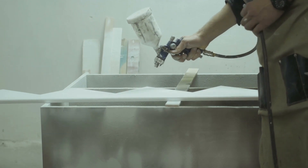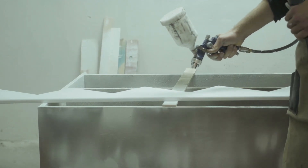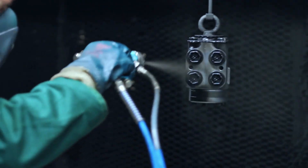If you are painting a narrow object and there is a broad fan pattern, this will naturally lead to overspray. So merely narrowing down the fan pattern will reduce overspray. This goes for airless sprayers as well, because by changing the tip size it will in turn change the fan pattern.